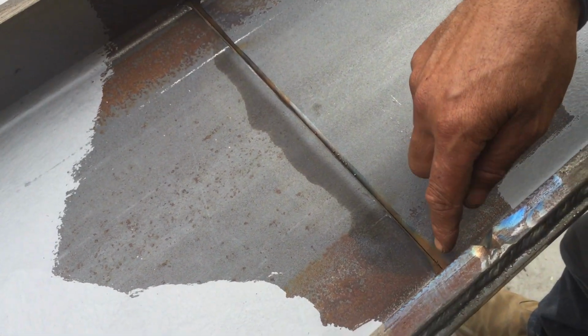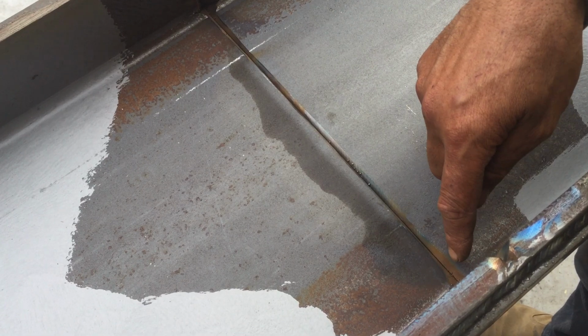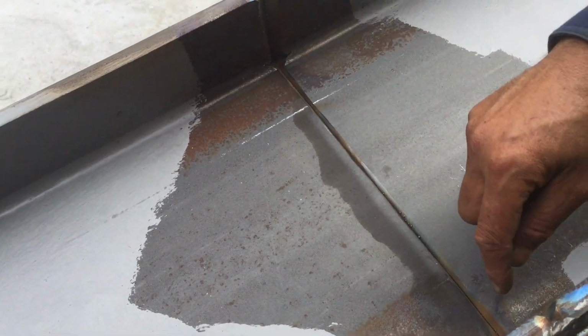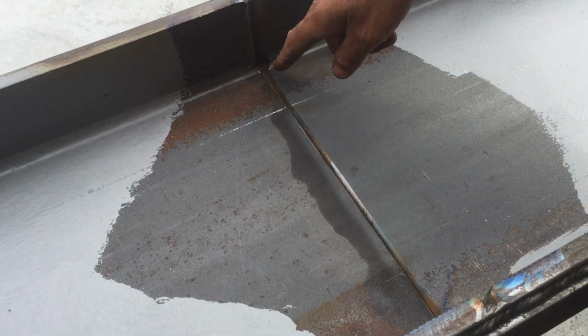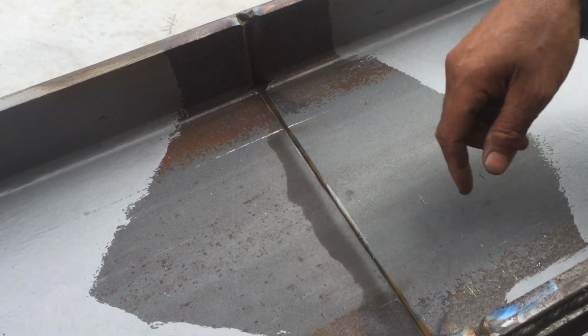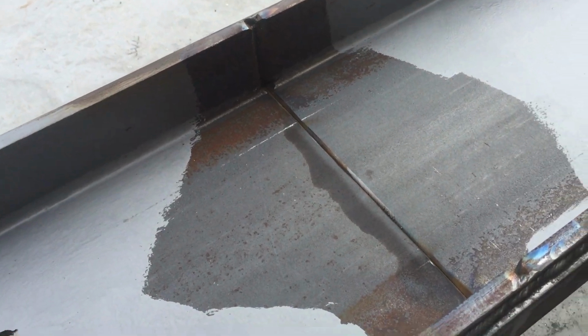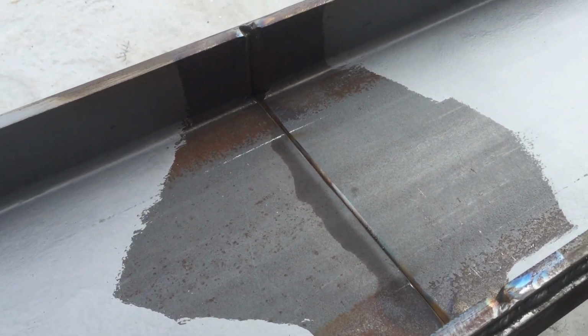What I'm going to do is get in there with the die grinder and the grinder and just grind it out till you get to the weld again, till I hit the weld, just go through a little bit into the weld, and then I'll do the same thing again, run a root run pass, and yeah, filler, root, fill, cap, and then I put the plate back on, and then a diamond fish plate on that one. Yeah, weld it in.